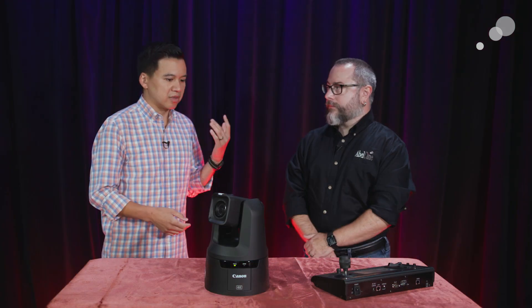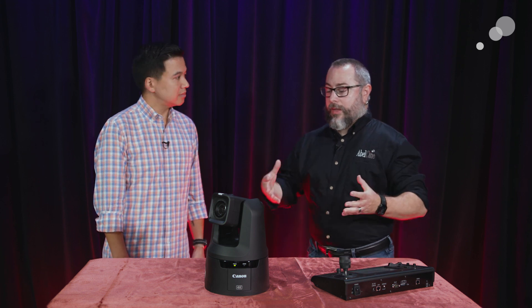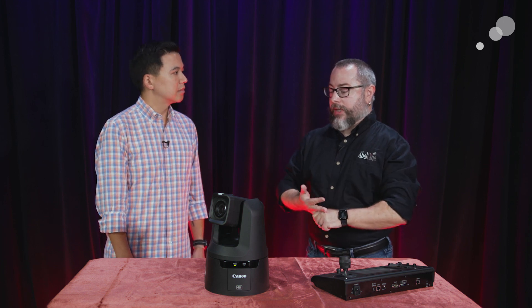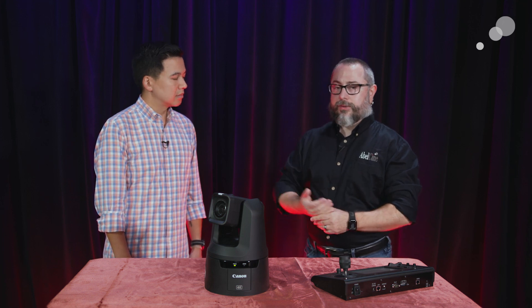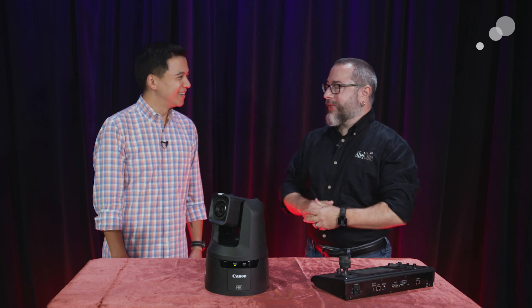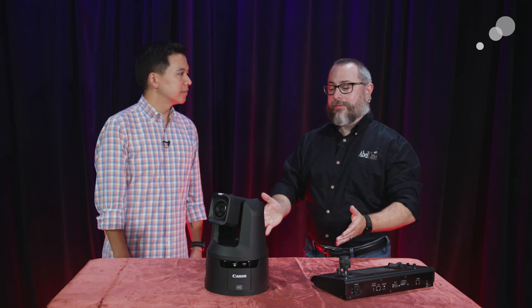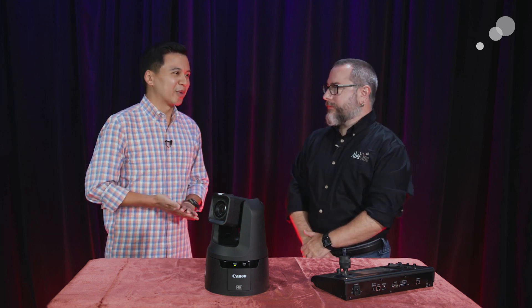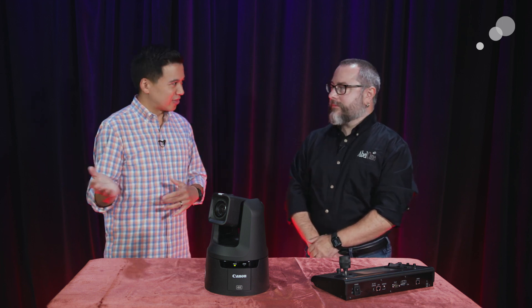One of the really interesting things is the fact that the 700 can actually do a dual output. I love having versatility — so if we can have multiple outputs like 12G SDI output, it also still has native IP output. A lot of our deployments utilize NDI technology, which is built into this camera — it has built-in NDI HX. I like redundancy, so if I can have multiple outputs going out at the same time, especially for live performances, having that redundancy available out of the gate is really big. And everyone always wants a different signal — someone who wants a clean, someone who wants a dirty with all the on-screen characters, someone that needs 4K, someone that just wants 1080.